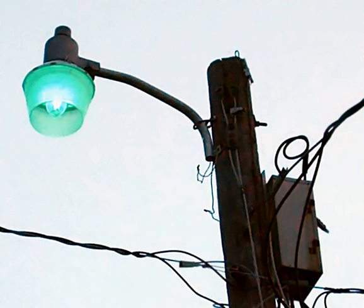Topic: Color considerations. To correct the bluish tinge, many mercury vapor lamps are coated on the inside of the outer bulb with a phosphor that converts some portion of the ultraviolet emissions into red light. This helps to fill in the otherwise very deficient red end of the electromagnetic spectrum. These lamps are generally called color-corrected lamps. Most modern mercury vapor lamps have this coating.